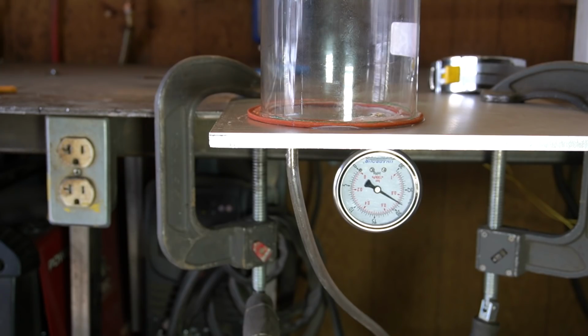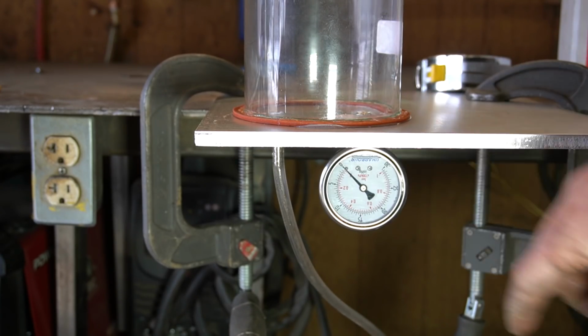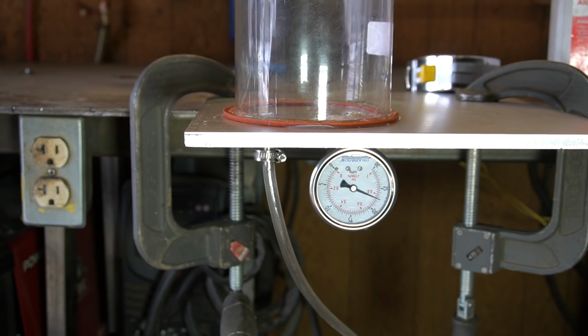Alright, I'm gonna leave you guys alone for like 5 minutes. Alright, round 2. This time I stuck a ball valve on the vacuum pump. Bang, look at that. So it really starts to lose its vacuum pretty immediately. So we definitely have some leaks and/or outgassing happening. Probably leaks. Oh, look at that. All I did was put hose clamps on and it's holding.